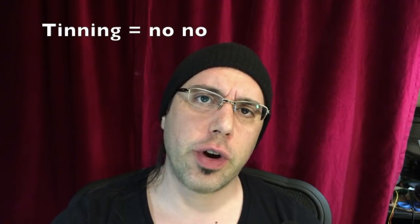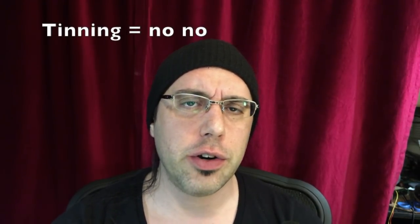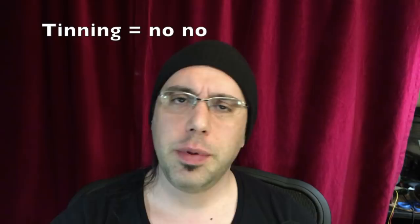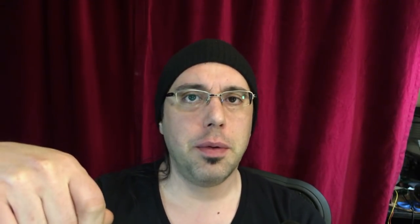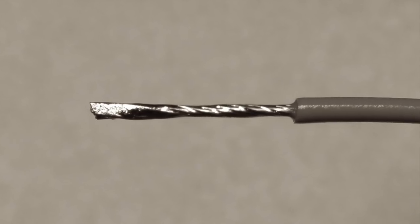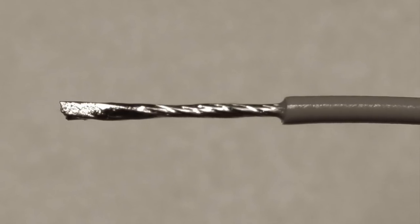The big power cables we run into these are typically not solid wire — it's typically stranded wire. Some people will make the mistake of doing what's called tinning, or full tinning, where you take the end of a wire and tin it with a soldering iron by melting solder until it's absorbed into all the strands. That makes it solid, and then they plug that in — which is a bad idea for these connectors and can lead to meltdown.